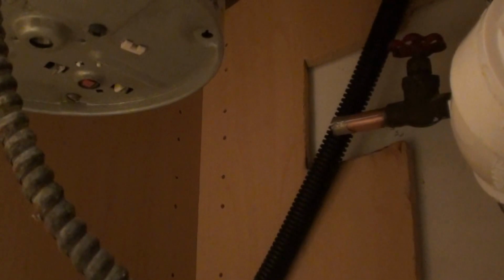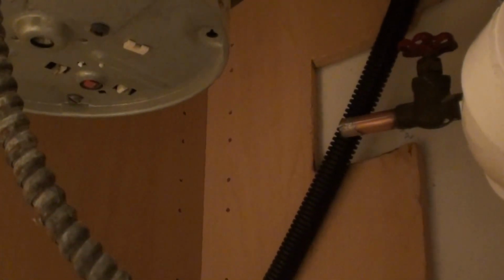You want, I can disconnect that dishwasher hose from the garbage disposal. They've got this one done properly. You're supposed to take it up high above your flood rim. Your flood rim is up here at the kitchen sink, and you're supposed to get it as high as you can. The reason you do that is if the drain ever backs up, it's going to back up into the garbage disposal and then it tries to go to its lowest point, which will cause it to start backing up into the dishwasher. But if you got the hose up high like that, it will not back up into the dishwasher unless the drain's back up and you kick the disposal on. So that's why they put that loop up in there.